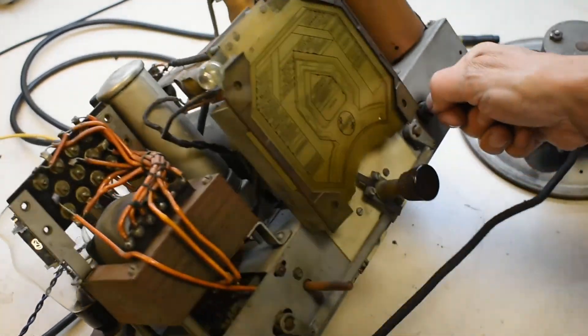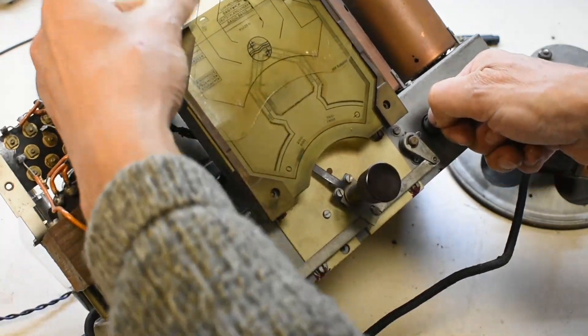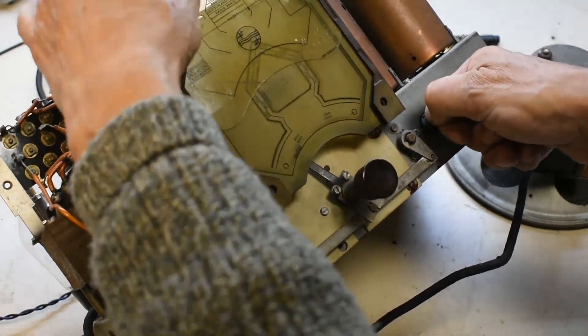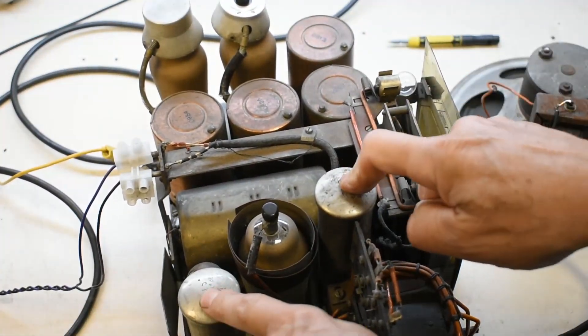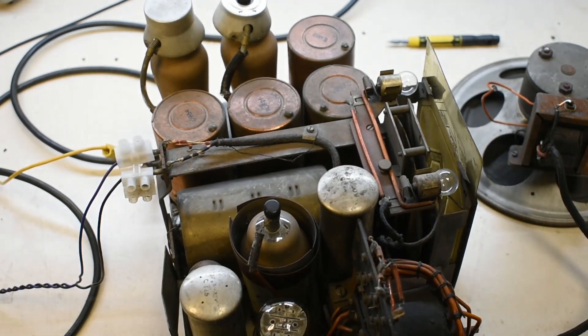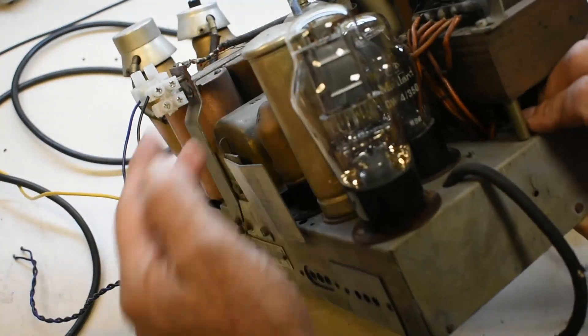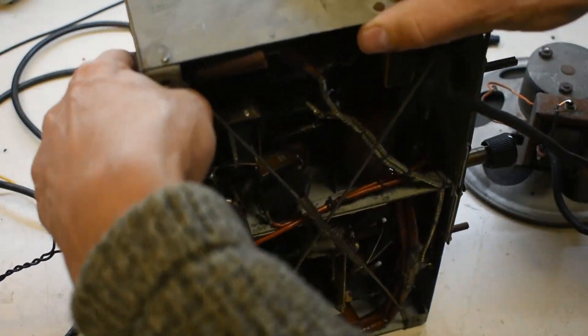There's the front. I've got the tuner at the front and the display at the front. Main transformer here. These two are smoothing capacitors, and there's a choke in between the two. Now these capacitors may need replacing — they were a bit buzzy, but it's still amazing it still works.